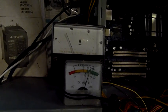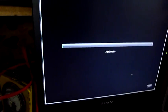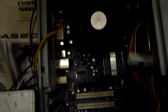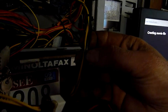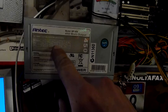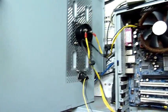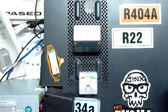Not a huge amount of difference though — it's just like a steady 6 amps. The meter does work out — that's a good thing. It gives you an accurate readout of what's going on in there, which is just the 12 volt CPU rail. You can see what I mean about the black stripe on the yellow wires indicating it's coming from the 12 volt 2, which is rated up to 17 amps anyway. That's working all right. Thanks for watching. The device has been modified — I just have enough clearance to get it past the CPU cooler. It'll sit just in there nicely. All finished and working.